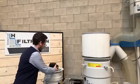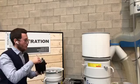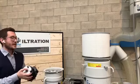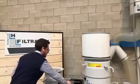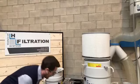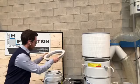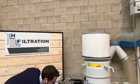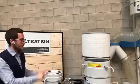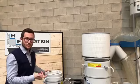Then we have the motor. Now the motor, again, to speed up the process, we already uncoupled and unscrewed the motor, but usually this motor is connected to the rotating drum thanks to this part. You just remove it and put it away. Now you see here I have the motor, and now I have to take this. Now what is different? I remark this because later you will understand the difference between this family and this family: where the internal silencer is placed and how you can have access to it.